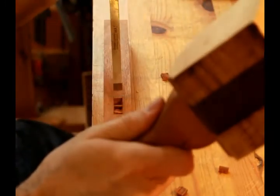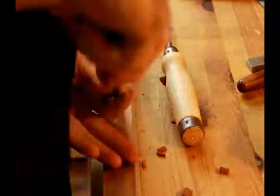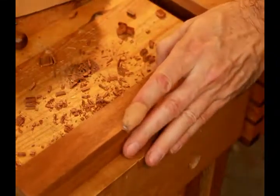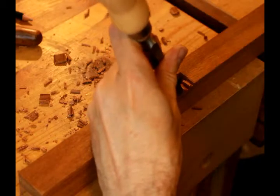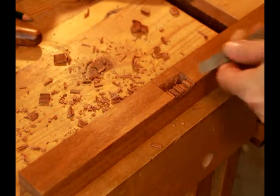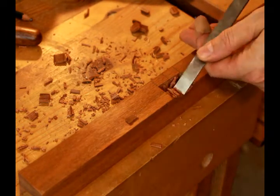Then it was off to making my mortices. I always love to make mortices with a chisel — it just blows me away that you can make a flat square hole in a piece of wood with a chisel. After I finished making the center mortice for the straight part, there were curves on the sides that I had to cut out. I used my chisel and started by putting little cuts all the way down to the mark of the curve on the outside, then I took a paring chisel and pared away the waste as much as possible.